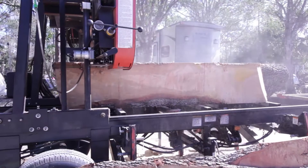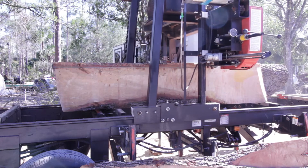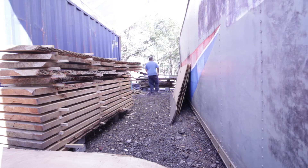The whole process is pretty cool. We initially took one of my smaller oak logs and milled it all up into one-by-one strips to use as stickers to stack between the boards — for airflow. He used a log I was probably going to use for scraps or firewood and made good use of it. All in all, I had about eight oak logs and two Australian pine logs, and we got them all milled up over about six or seven hours.